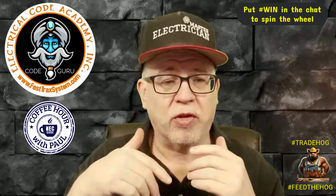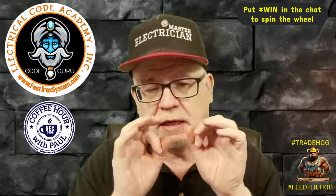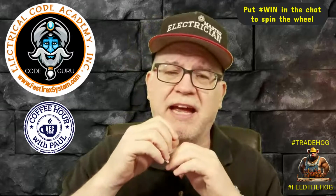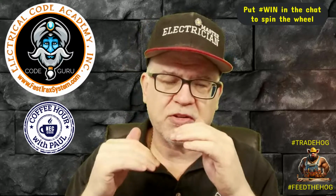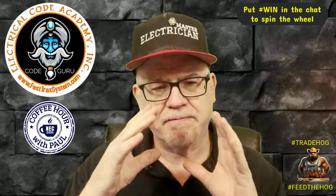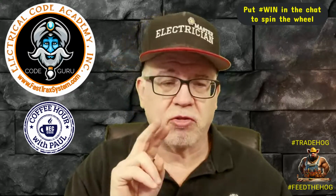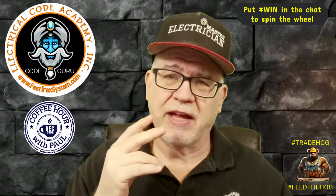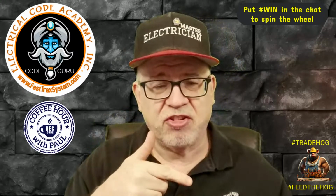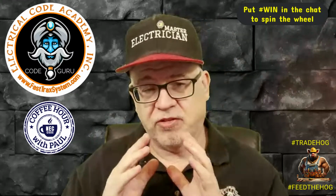Because a cable's got more than one conductor in there. And it is more complicated to try to do each conductor, because you still have the interstices, the volume between the conductors. You still have the sheathing. So we're trying to find the area. Okay, that type of thing. And so yesterday, go watch part 2, and I show you that example, and I even linked it in the chat for how to calculate the area of a cable assembly, that type of thing.